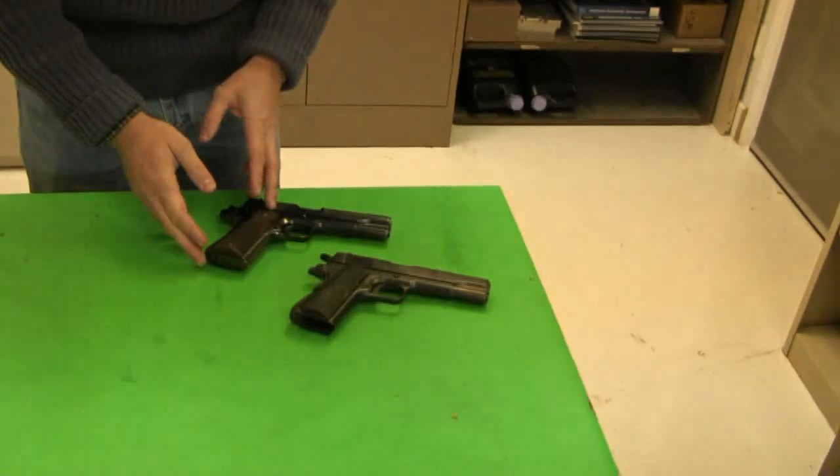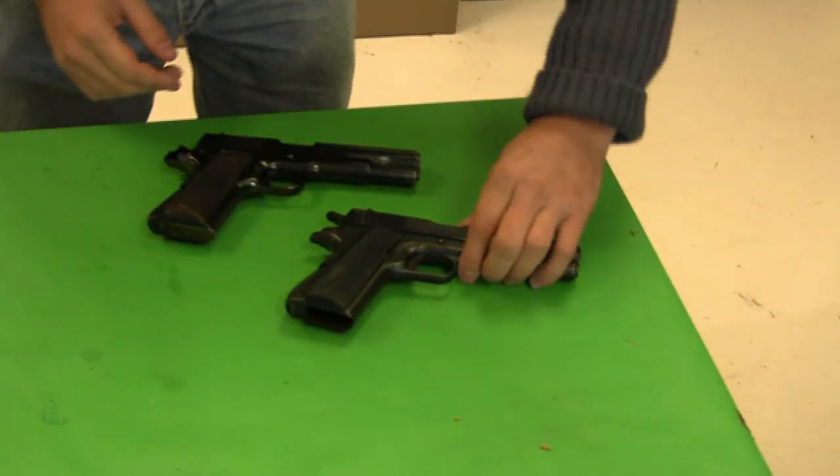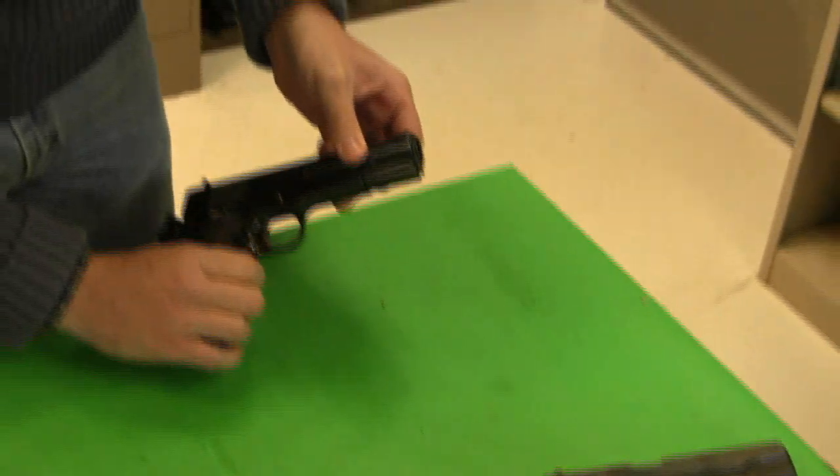The history of the Obregon is a little cloudy. We don't know a whole lot about them. About 800 were made, and we believe they were made in the mid-1930s. There was a Mexican patent applied for and granted in 1934, and an American patent in 1938. The 800 or so pistols that were actually made were made between those two years. They were intended for a Mexican Army contract, which ended up falling through — the Mexicans simply continued to use the standard 1911. These used 1911 magazines and standard .45 automatic cartridges, and the whole lower frame is very similar to a stock 1911.